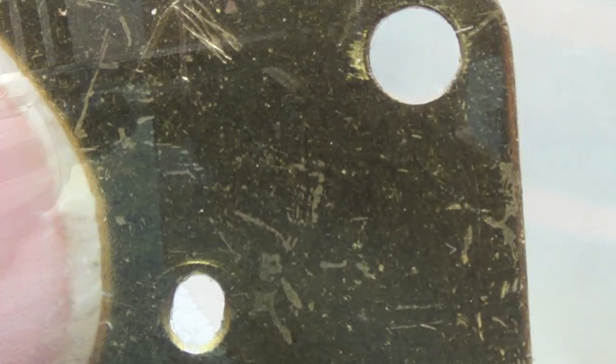Okay, I filed out the bottom so that it's got the same amount of wear, or filed out the unworn side, same amount as the worn side. So now when I use the reamer to cut the hole, it'll center. I'm going to go ahead and install this back in the plate, so that I can cut it easier. I won't have to try to hold this by hand.